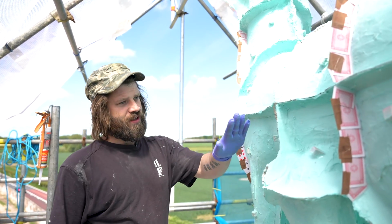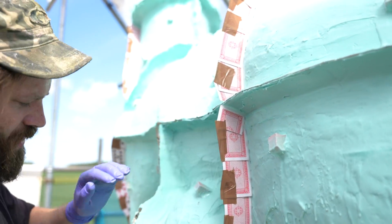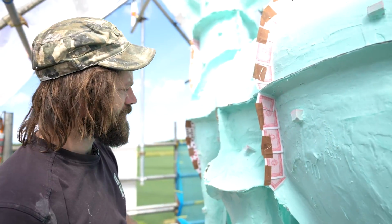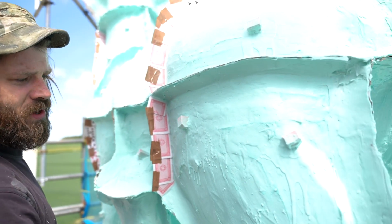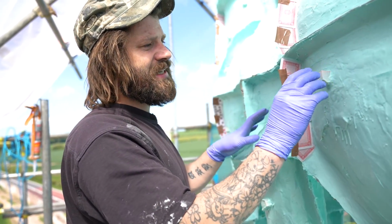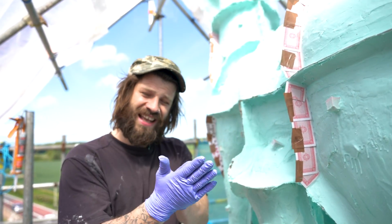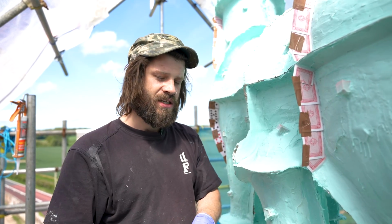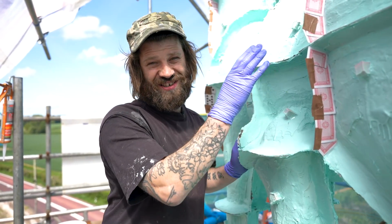Yesterday, Lucas made these divides, much like we did with the rubber, but these are to indicate where the jackets are going to be separated. He added these little rubber locator points so that when the jacket goes on, it molds around these lugs, and once the mold's ready to be taken away, the jacket's then gonna have a hole in it. So when the rubber goes back in, it's completely located exactly where it should be, so when you brush in your wax, it's gonna give you a true representation of what's underneath.